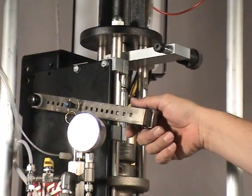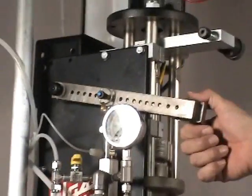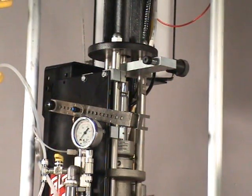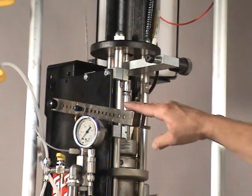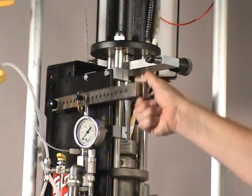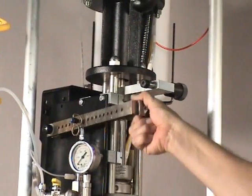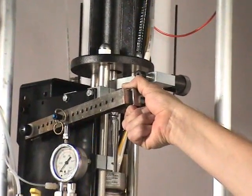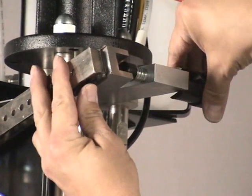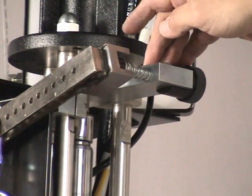Next, we are going to re-prime the catalyst pump. With the material primed, we are now going to go back to the catalyst pump and we are going to hand pump the catalyst until the gauge starts to read pressure. Once the gauge reads about 200 to 300 pounds, we are going to stop, bring the drive arm up, and reconnect it to the drive arm of the material pump.